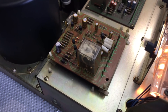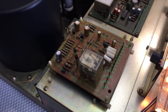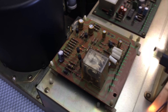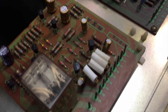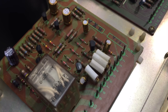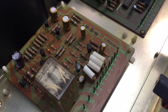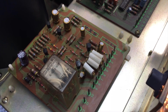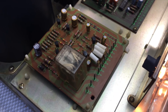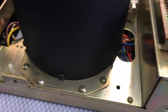The next was the protection circuit. It has six electrolytics - the big ones at the back and then these little guys over here. These are 0.22 microfarads. I was in two minds about replacing them with film caps, but I did have 0.22 microfarad Nichicon gold electrolytics, so I put those in. The chassis was cleaned as I went along.